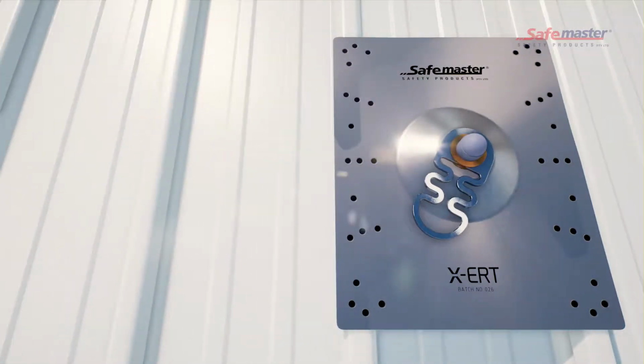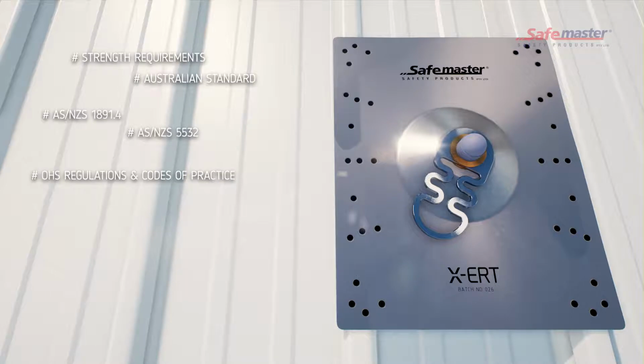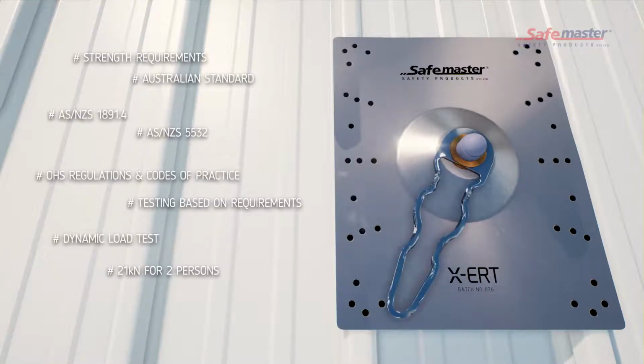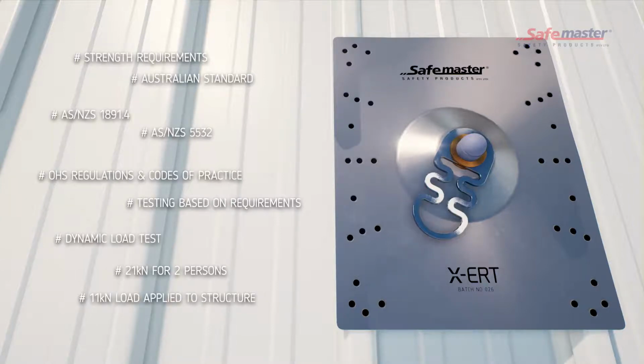Conforming to the strength requirements given in the Australian standards AS/NZS 1891.4, AS/NZS 5532, and relevant OHS regulations and codes of practice. Testing is done based on requirements outlined in the Australian standard. A dynamic load test at 21 kilonewtons for two persons, and the load applied to the structure is approximately 11 kilonewton.